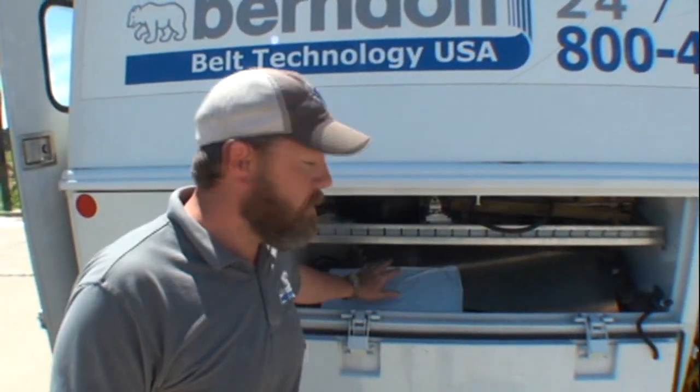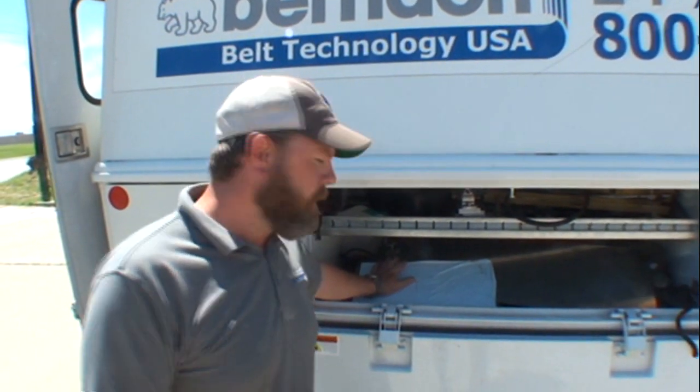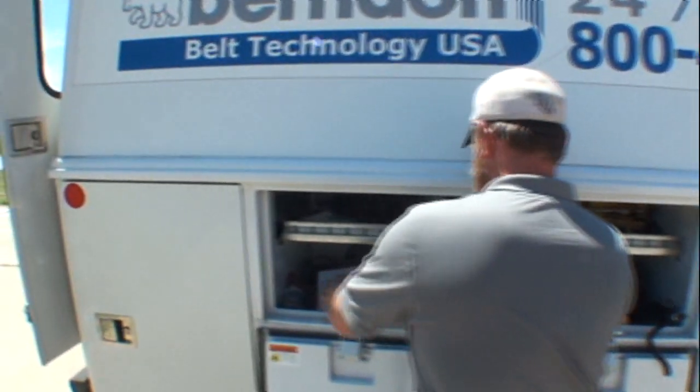Not all of them. Most industries — the candy making industry, the baking industry — they all use metal: stainless steel or aluminum. In the baking industry it's mostly carbon steel, but in the chemical industry it's all stainless. The carbon steel doesn't rust in the baking industry because they always keep it lubricated with food grade oils.